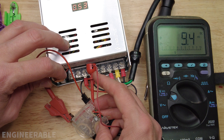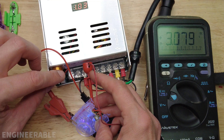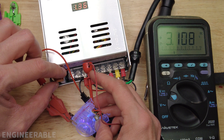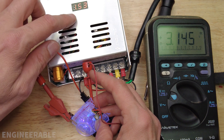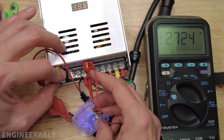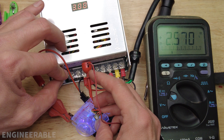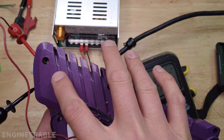It still shows three volts on the output, until which point it just drops out — so it only takes about one volt on the input to get three volts out. The LEDs are brightest at about 1.5 volts on the input, and they start to dim when you reach two volts, then brighten up a little bit again when you reach three.